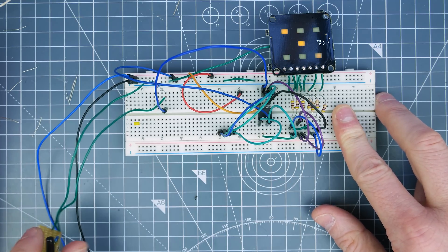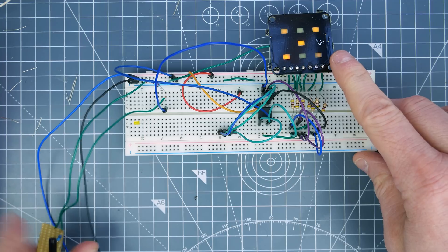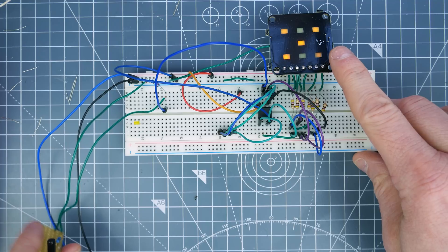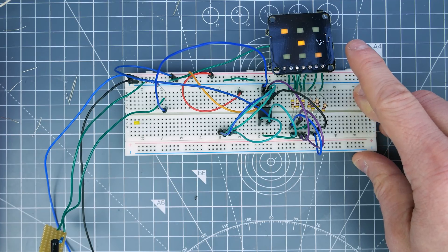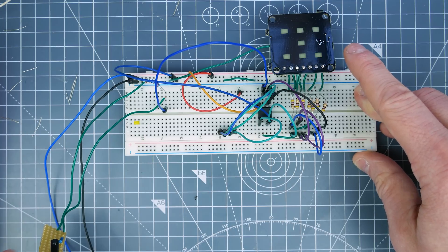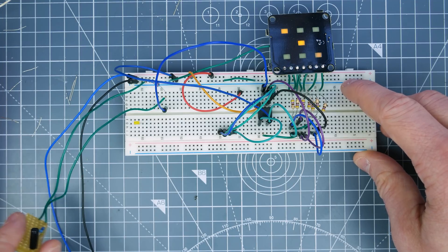You can see up here the numbers are changing based on how much I'm moving this thing. It's currently running off three volts and drawing about five milliamps — probably a little bit more, my meter is not entirely accurate. I've programmed it so that it forces it to ignore the shake switch, confirms the number by flashing four times, and then goes into sleep mode. It's asleep now, but we're going to wake it up with the shake switch.